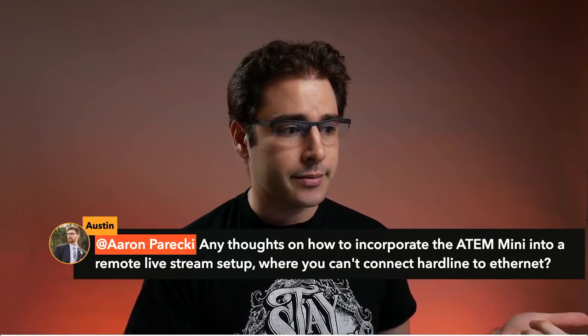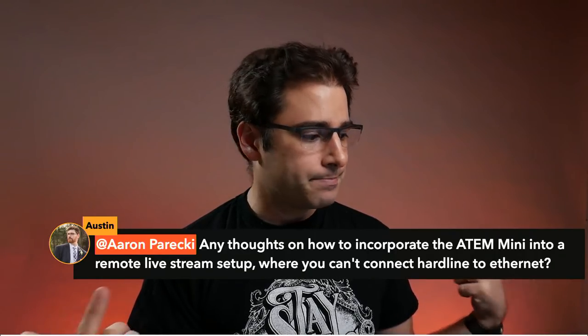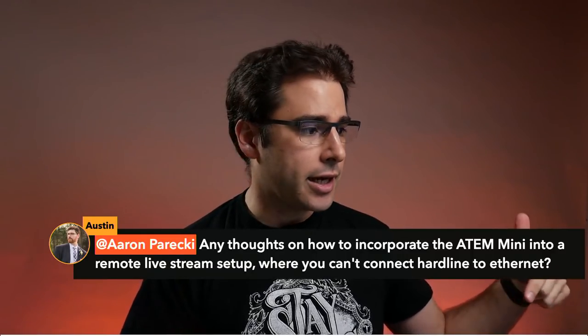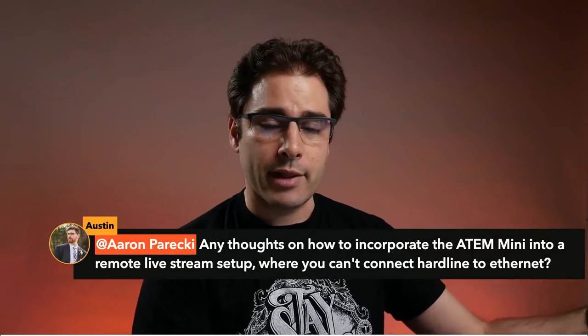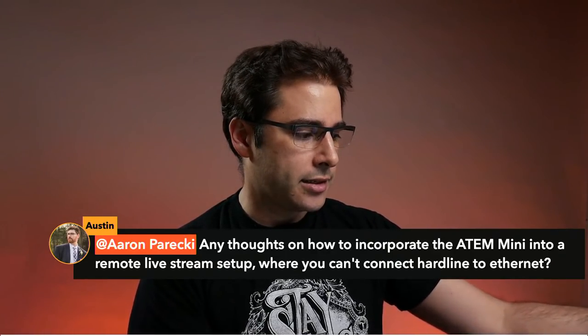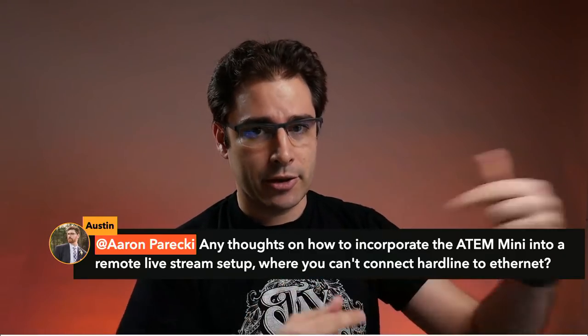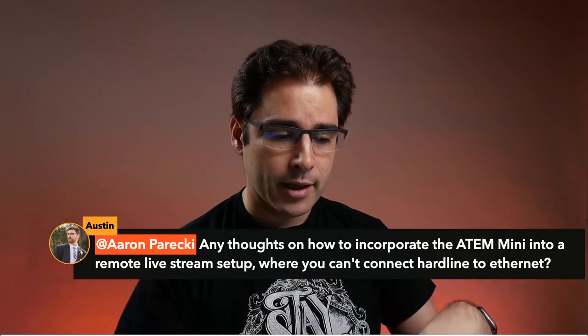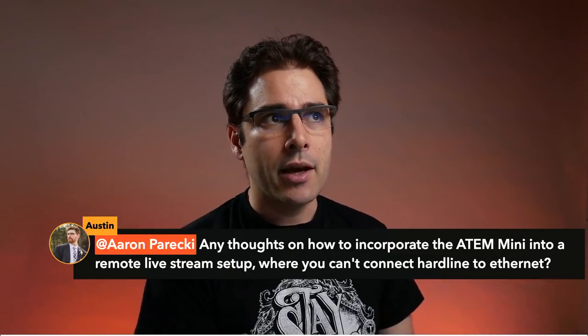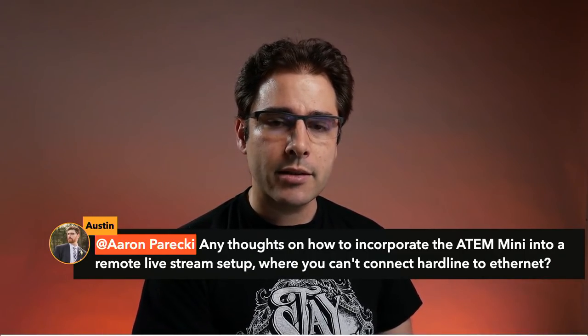In the launch videos, Blackmagic was demoing using the ATEM Mini by tethering your laptop's internet connection over USB or over Ethernet. So you plug the Ethernet into the ATEM Mini, plug that into your laptop, share the connection, and then your laptop's Wi-Fi can be used by the ATEM Mini. That's probably the simplest way to do it.